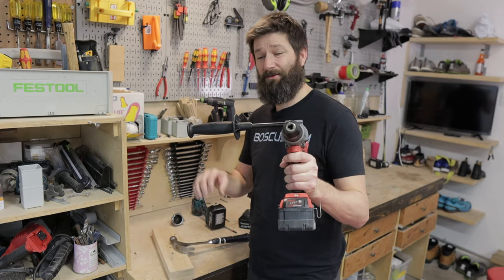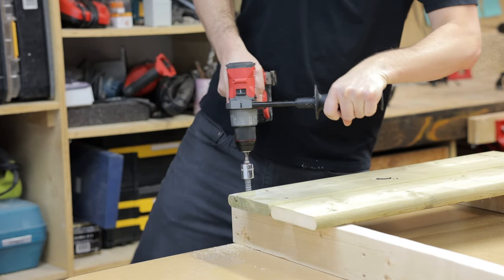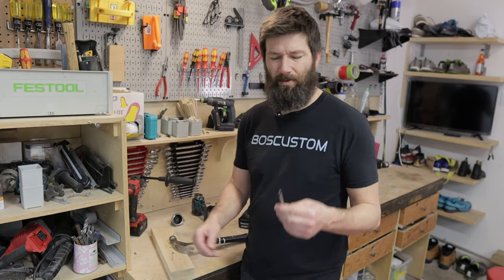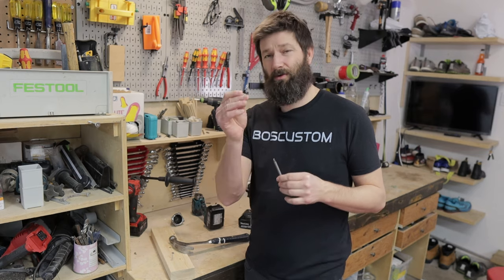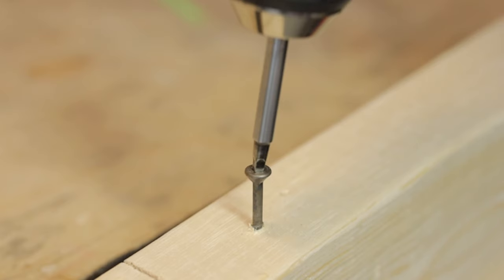There's a tremendous amount of force — that's why a heavy-duty drill will come with one of these handles, because you have to put the equal amount of resistance that the drill is putting out. That's why with a drill bit, either a Robertson or a Phillips bit, there's a lot of pressure that builds up on that bit, and if it's slightly off-axis, that bit's going to cam out.